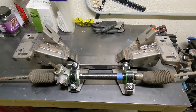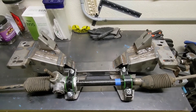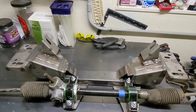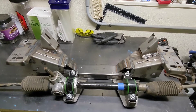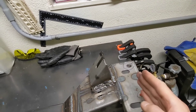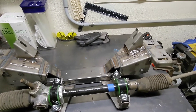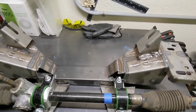Here's our Frankenstein cross member. I'll spend a little time showing the work on this one. This is the Excessive Manufacturing AE86 cross member that's supposed to fit the RA21 — well, it doesn't really fit. It hangs over the edge this much, and you have to put shims on here, which puts the control arm locations too low from where they previously were.